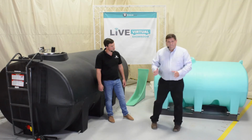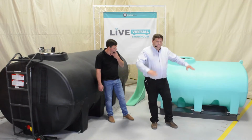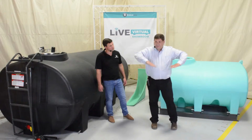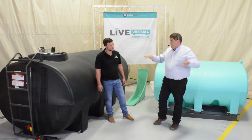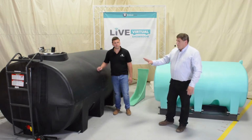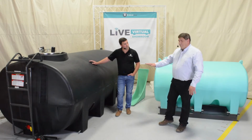except for the sump. But like Michael talked about, they have the trough in the bottom, and the legs have some slope, some taper, because of the way they're molded and the thickness on the outside edge. So it's still going to all drain out, even though they're not a completely sloped bottom. The freestanding or flat bottom tanks, we call them freestanding to be clear, those do not have a slope bottom. Those are a flat bottom in the tank.